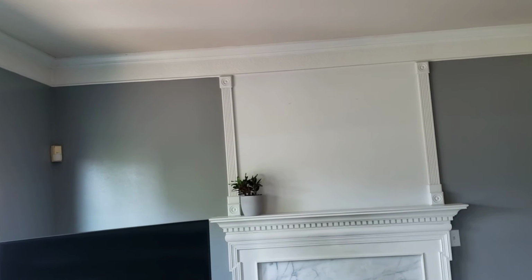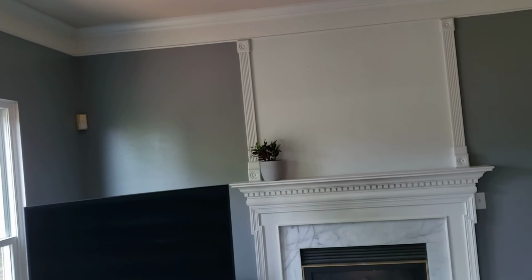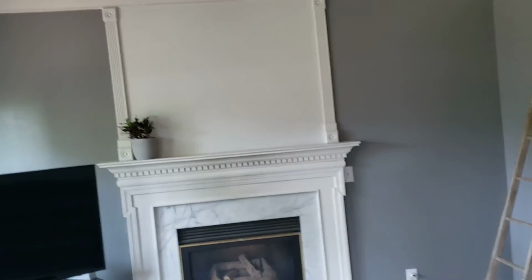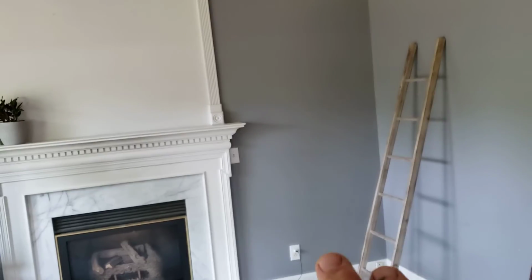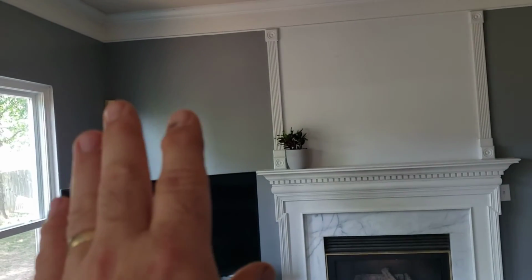The center section of this would actually be built out forward to where it would actually be something out of plywood, paint ready, and it would be painted the same color to match the background of the gray. That piece in the center would have a headpiece on it that matches moldings on the hutch on the left and the hutch on the right, and would be connected to those two. So you'd actually have 3 distinct pieces. This piece over here with the top and bottom and the counter, the piece in the middle with the build out and the cables, hiding the cables for the actual television, and this piece on the left hand side would be the hutch and the base again with the countertop.